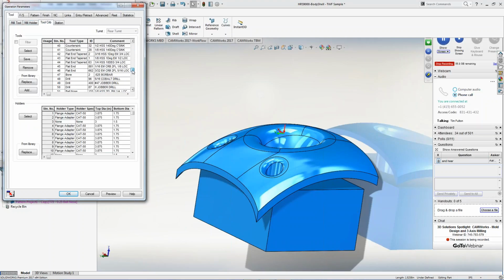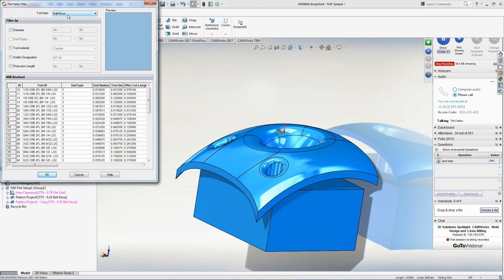Well, we've always built big molds before, and now we've got to fix this one, and we don't have a ball end mill small enough. I'm just going to go to Add Tools. I'm going to choose the tool off the ball end mill list, and I can go through. Is it an 1/8 inch? Is it 2 flute because I'm running softer material?